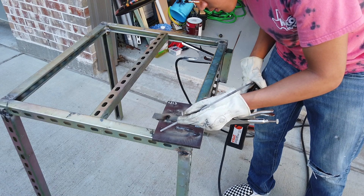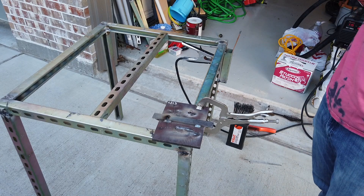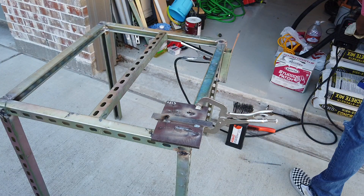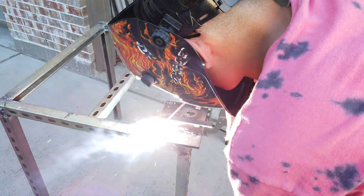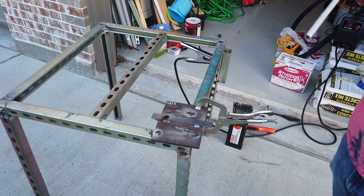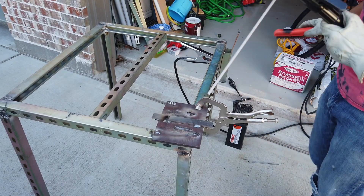It's more like right there — just keep it really close. Let me show you on camera. I'm going to put a rod down here. I just hold it and the pool is forming. One thing that is probably affecting your weld right now is the wind. The wind is actually kind of annoying because you can see your shielding gas blowing away as you weld.